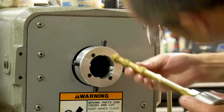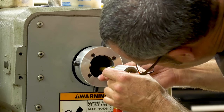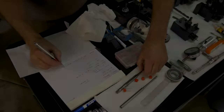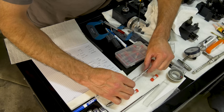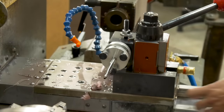The next part was honestly pretty cool. If you're wondering what this guy is doing with a hand drill in the muzzle of the barrel — now you'll see what was going on. Matt ended up taking these fixtures that were attached to cutting fluid and threading them into those threads he had made in the muzzle of the barrel. This in turn would allow cutting fluid to pass through the barrel and push all the material cut by the reamer back out. And of course, documenting everything along the way. He had actually never chambered a .243 and this reamer was brand new, so first he needed to get a guide piece — again making sure the reamer stayed centered inside the barrel.